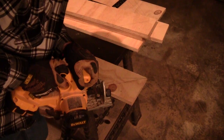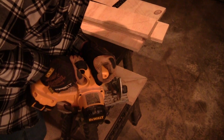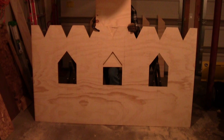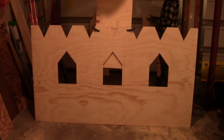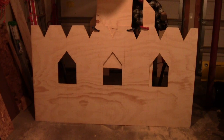After finishing the walls, I cut out smaller strips for all the spires. This is where having a table saw would make life easier since they're all the same width, but I made do with the circular saw and a guide. After all the pieces were cut out, I wanted to see how everything looked before screwing things together — I really had no idea what it would look like at full scale. So I did a dry fit with clamps, using angle brackets to hold the corners of the walls together, which allowed me to do a temporary fit to make sure I liked how everything looked.